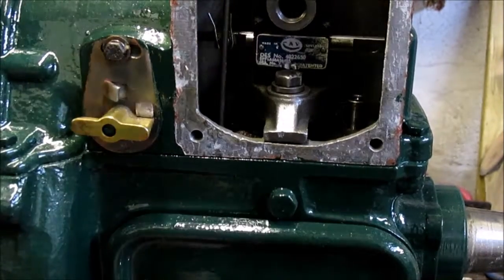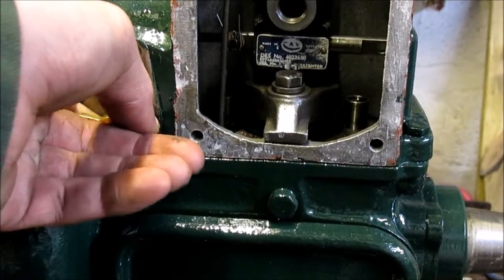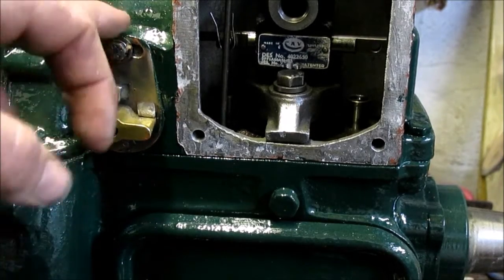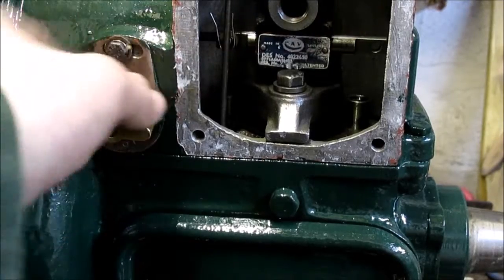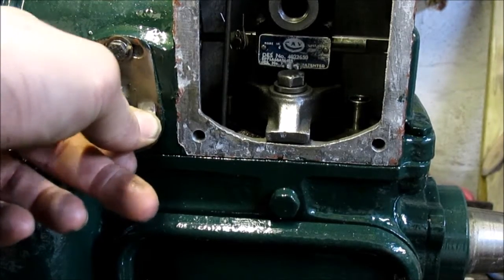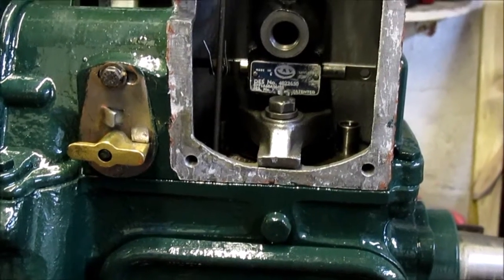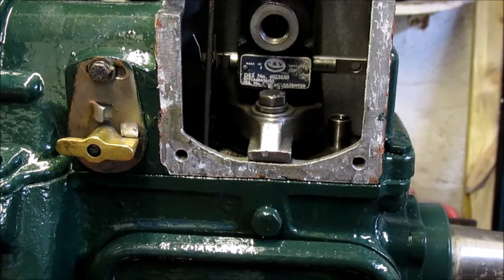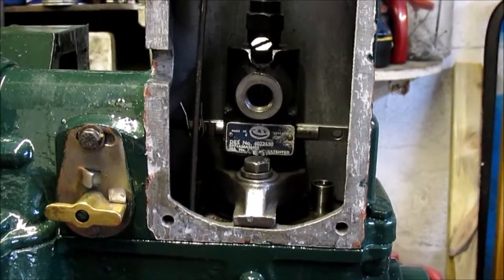Also - and I don't know if this will work - you know how on YouTube people slow down their engines by holding the thing near the stop? I'm thinking that at rallies, once the rings are bedded in, I could undo this again, mark where it is now with a bit of black paint, then move the quadrant a bit more towards the stop. That might let it idle a bit more slowly, get a bit hotter, burn cleaner, and use less diesel. When running under load I'd put it back to normal. Anyway, that's a good night's progress - thanks for watching, and stay tuned for part 16.